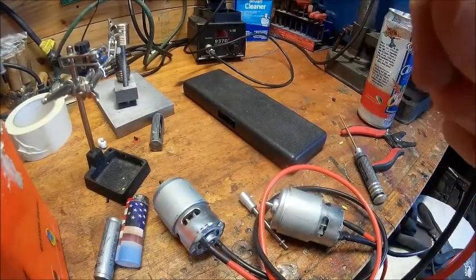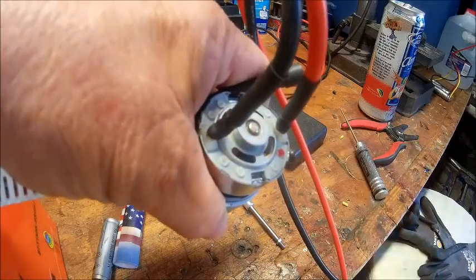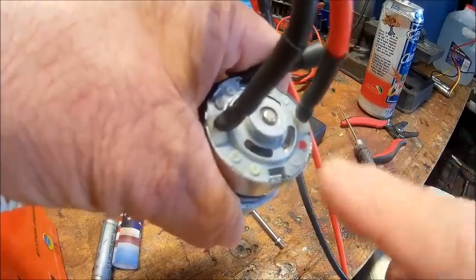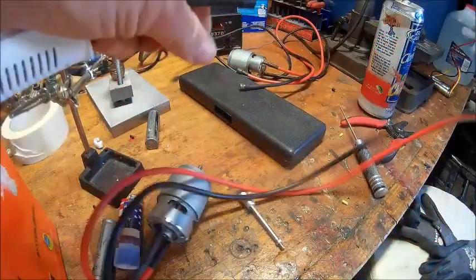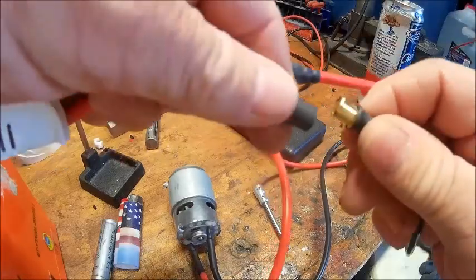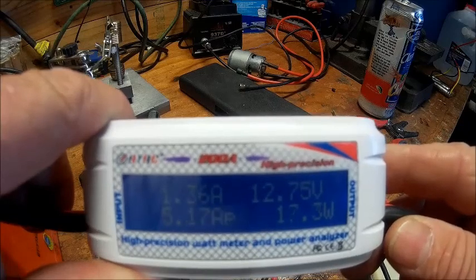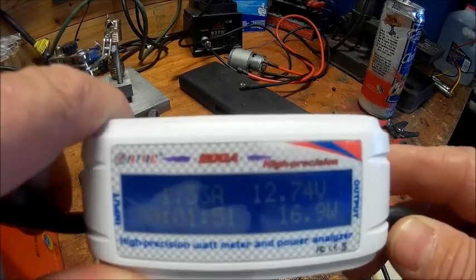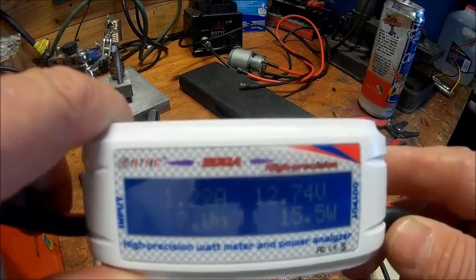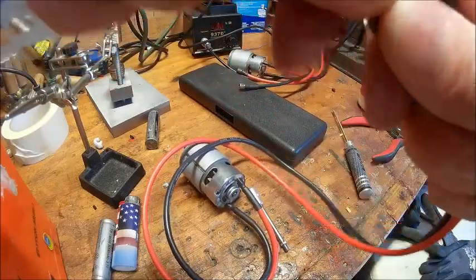Now I'm going to unplug that one and plug in the motor in the proper polarity — the one the manufacturer intended. You can run clockwise or counterclockwise with these motors, it doesn't matter. And if you notice the back bushing, these already have a thrust bearing in them, so I won't be putting a thrust bearing on this particular one. They are a high torque motor. You're going to see whenever it's running the proper rotation it's going to be a few less watts — not a whole bunch of difference, but a little less. Guys, if you like what you're seeing, hit like and subscribe, and thank you very much for watching.